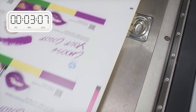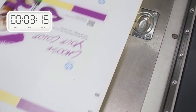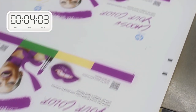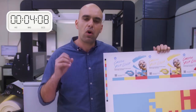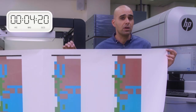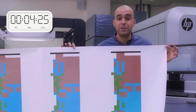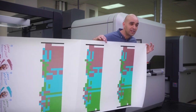Once we got to the right color, it's important to keep those colors consistent from the first page to the last, regardless of the job length. Once we're identifying any variation in the spot colors, we're automatically updating the colors to the right colors by applying digital style corrections. So to encapsulate what we just saw, we have perfect accuracy in less than three meters of waste, less than five minutes, and only three iterations.